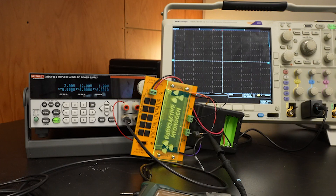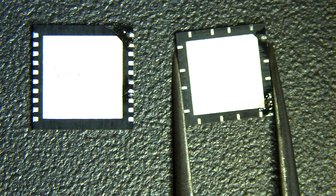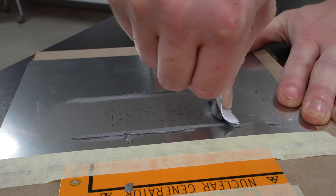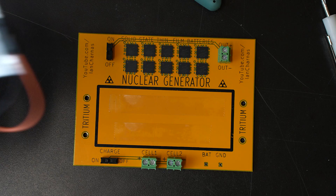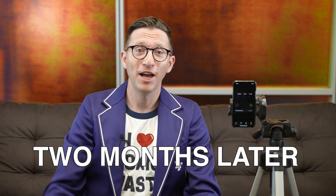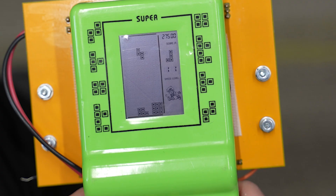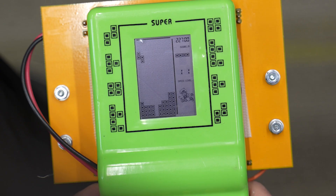After a week of debugging, I discovered the solid-state batteries weren't holding a charge — I think it was just a bad batch, but I couldn't find any replacements. All I could find were these other solid-state batteries, which are even smaller and even harder to solder. So I designed a new circuit board, made a new solder paste stencil, and positioned the new parts to within 9 thousandths of an inch — that's smaller than Abraham Lincoln's lips! Then I melted the solder and charged it up for a whole two months this time to really save up some energy. It's been two months. We're setting the bar at one minute of nuclear-powered Game Boy time. We're gonna select Tetris and start. It actually lasted a whole hour!